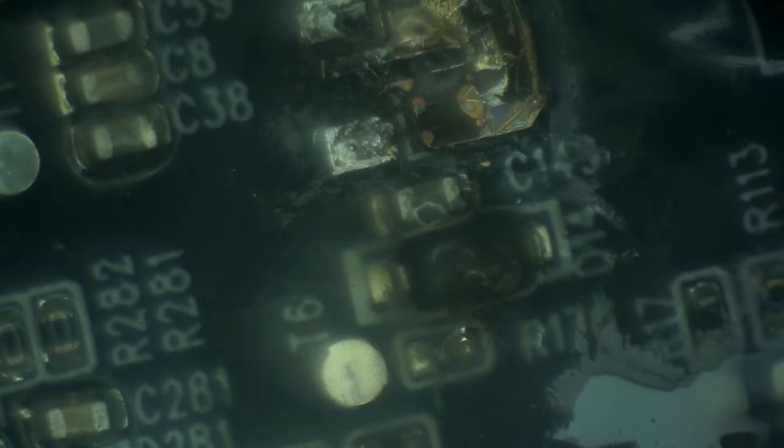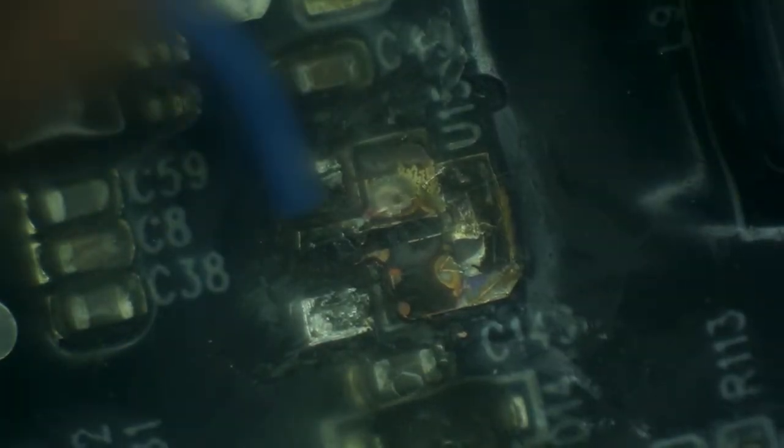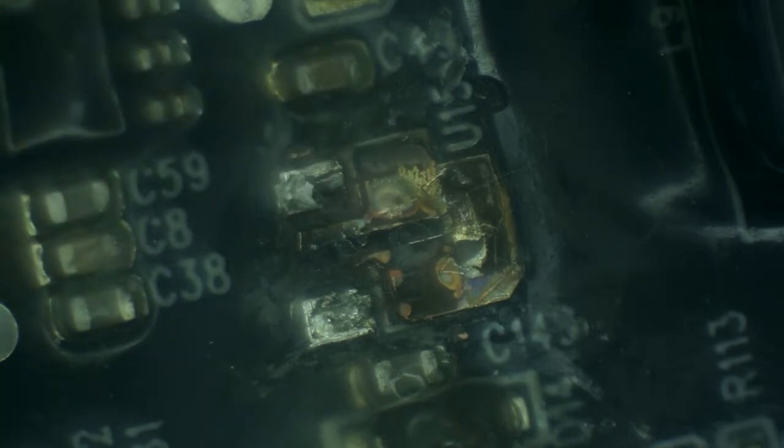So what I'm going to do while I'm under the microscope is attach my test wires. I'm going to have a voltage injection implemented here. So I'll take a couple of wires and attach them to the output. I'll give it very, very low current on the output at 3.3 volts, and I'm going to see what warms up. But there is clearly a short. The D14.